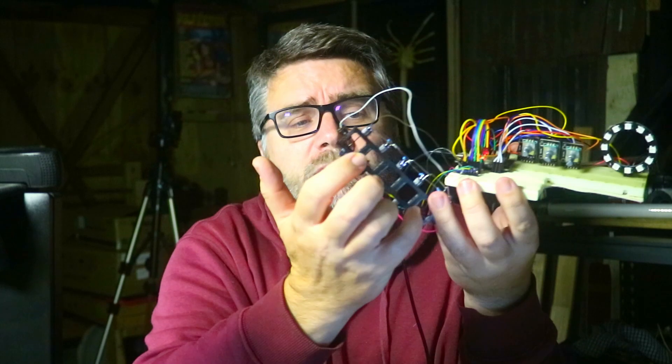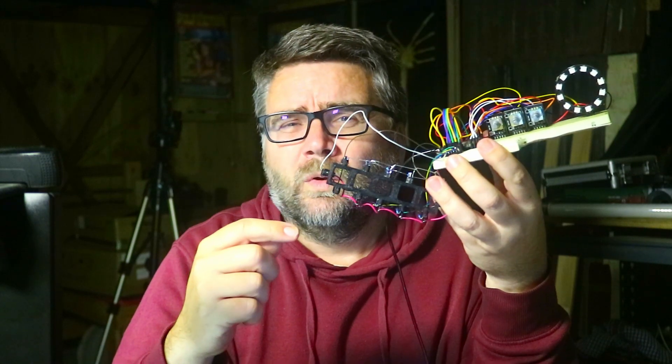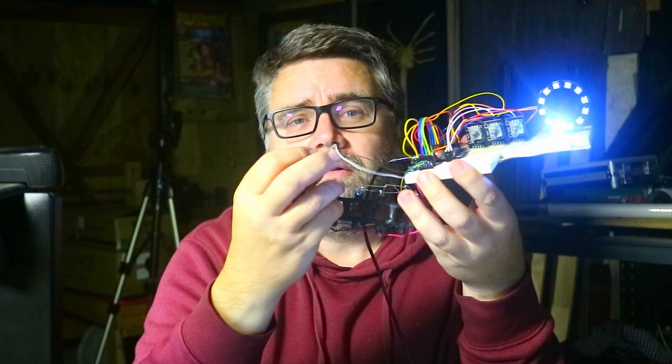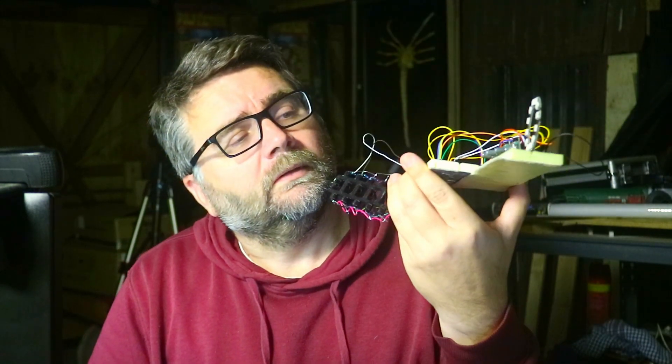It's got all the analog inputs on the ESP32 measuring the input from the infrared transmitter to the receiver. It has an analog value, and if that analog value drops below 10, it's definitely being pushed — it almost always goes to zero. When the light is going across at a longer distance the value is a little weaker, but it's definitely within range and it'll work. Same in the other direction too. So as long as it drops down to zero, it'll detect when the button's been pushed.